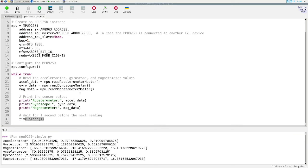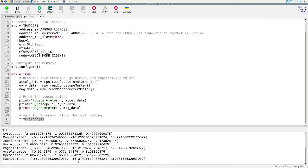One thing you'll notice is that even if the device is stationary, you may see non-zero values for the accelerometer and gyro. The gyro should read all zeros at rest, but these sensors come with an inherent bias — especially cheaper ones like the MPU 9250 and MPU 6050 — that we have to calculate and subtract out in code. Don't be alarmed; we'll cover calibration algorithms in the next tutorial.